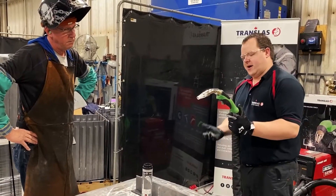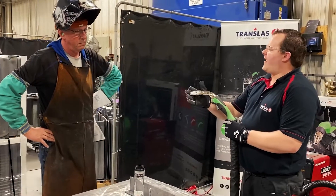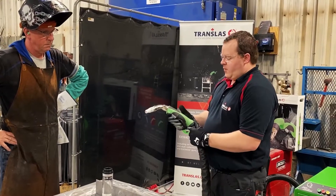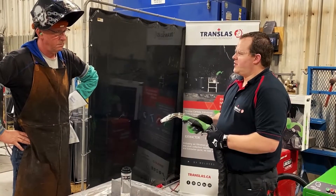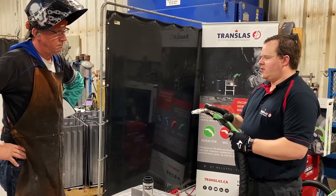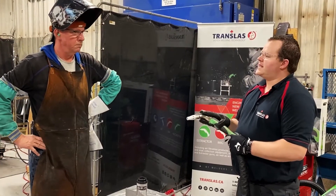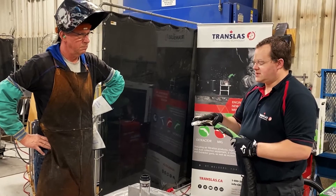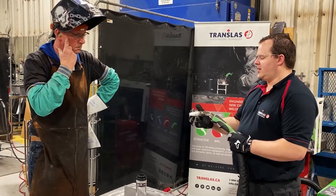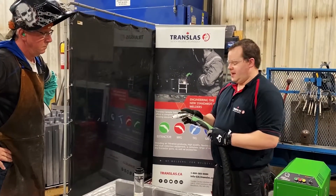Let's talk a little bit further about the gun itself. This is a 45 degree angle neck — most common for us. We also have 60 degree and 180 degree. We have three versions of guns: a 250-300 amp, a 400 amp, and a 500 amp. All guns are air-cooled or water-cooled. We have 100% duty cycle with this gun. When you weld, because you're not only sucking the fume but also providing an air flow through the gun, it creates a cooling effect on the whole gun.